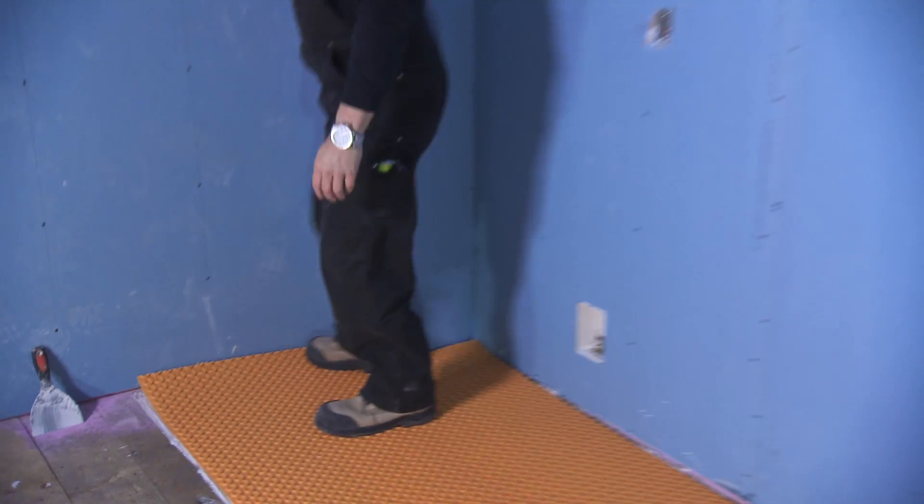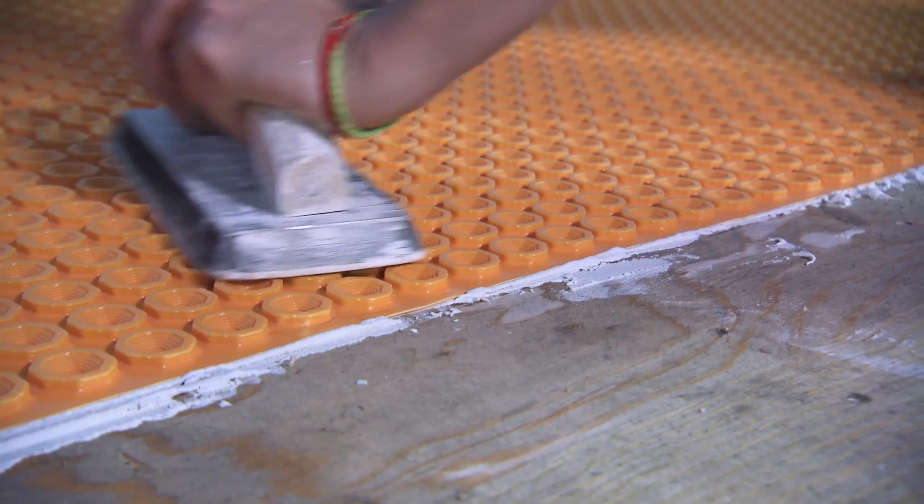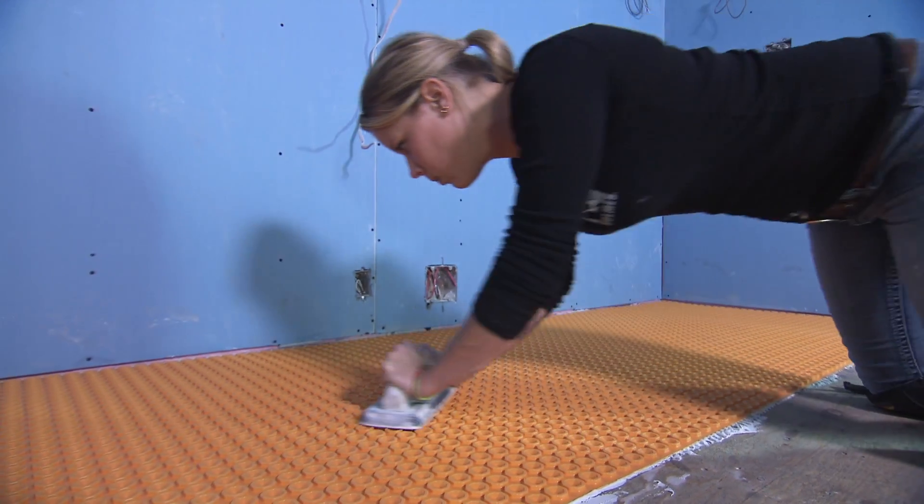Before, if I wanted to put in floor heating, I'd have another layer — whether it's a mat or cables — and it would be a little bit more thinset than the tile. What that does is gives me a high transition to another floor. By removing that one system, it's a low floor. It ties right into hardwood or carpet, nice and simple. The transition follows.